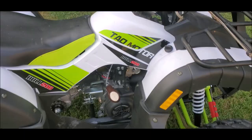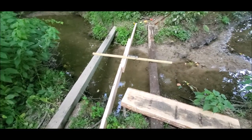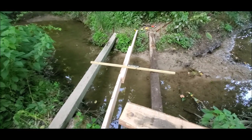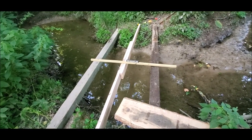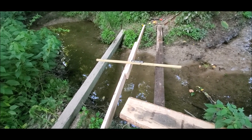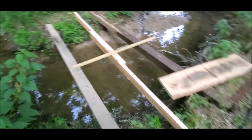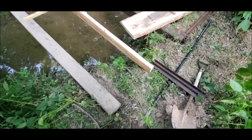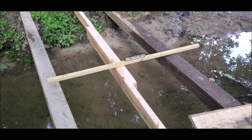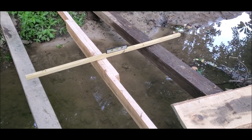Here's where I am with the build: it's going to be 12 foot long by four and a half foot wide. I have the two outside stringers — really like whaler boards — they're six-by-sixes, 12 foot long. The middle stringer I'm getting ready to dig out so I can set it in, then I'm going to level everything. It's four and a half feet wide, so I'll use a torpedo level and a straight stick since I only have a four-foot level.